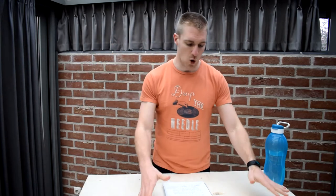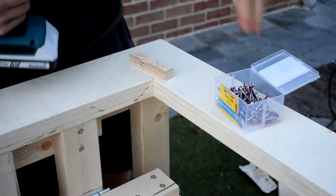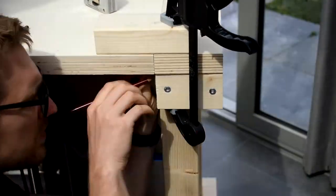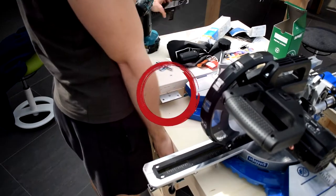Then it was time to make some mounts for my table insert so I could make the table flush. I came up with a great idea to use some scrap leftover plywood strips diagonally on the back end, and I could put two corners on top of that. Then I used some L brackets in the front to make sure the table is supported in front as well. One thing to make sure is that when your table saw comes up, it doesn't interfere with the L brackets.